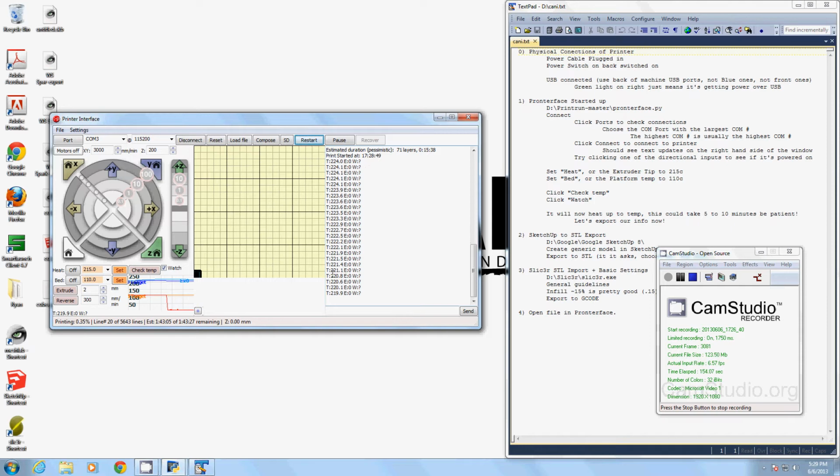You'll notice on the left-hand side, the tip, or the extruder, is dropping down to 212, and that's because in Slicer, we set our start print temperature at 212 Celsius, which is a little bit different than what you see here in Pronterface. It's trying to maintain it at 215, but Slicer's told it to print at 212. As soon as it hits 212, you'll see this switch. W goes to 4, 3, 2, 1. It counts down, and then it'll start moving on the build platform.